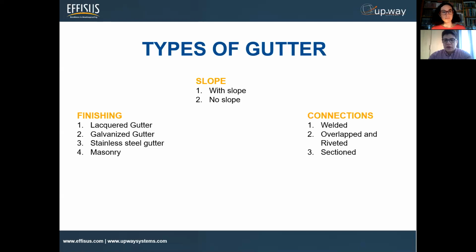And again, you don't have as much flexibility. We know how these materials expand and contract differently, so we need a material with flexibility to make the sealing, the joint and the connection itself. So we need to take a look into the details, understanding the finishing and the extra materials that are going to be applied. The length, of course, is very important to assure how many connections you have on the gutter itself.